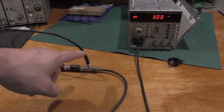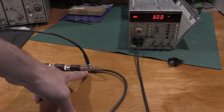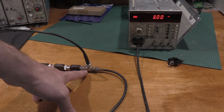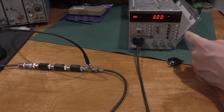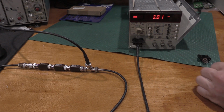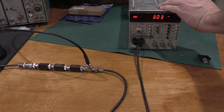So the 505's off right now. This is coming down. This is coming in. We're going to collide a bunch of signal at this point. It's going to mix, and then we're going to adjust the distortion of the signal that comes out. But this should give us a very precise 1% distortion signal, which is what we're actually going to be adjusting for. See, I take the 80 kilohertz low pass out, and it goes nuts.